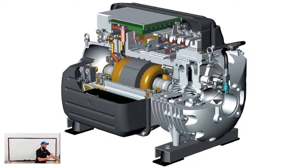Anyway, so you see your impellers there. Moving further back, you get into the rotor. Part of what has made this compressor so special is, one, it's tiny, and it packs a punch for what it can do. The impellers on this thing can sit in my hand. They're just inches in size. But this compressor will run itself at really high rates of speed. It's really easy for this thing to hit 25, 30,000 RPM in a heartbeat. So yes, it is an extremely high RPM motor. I forget where the RPM tops out, but I think it's in the 30s, if not pushing 40,000 RPM, something like that. It depends a little bit on which compressor you're looking at.